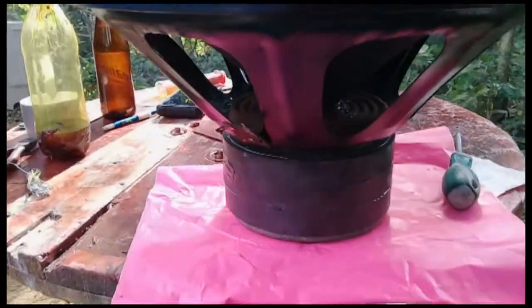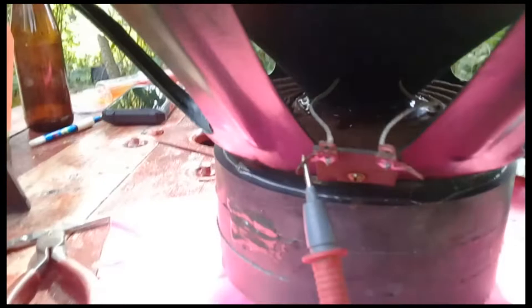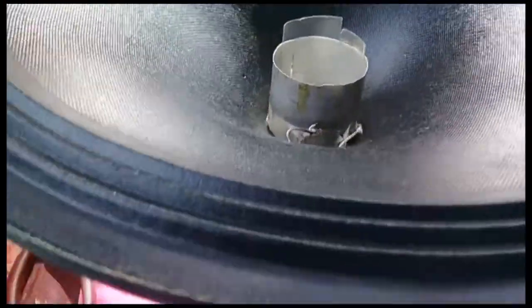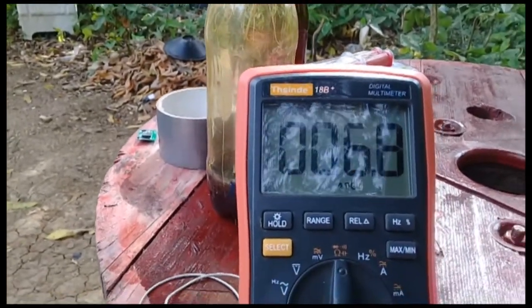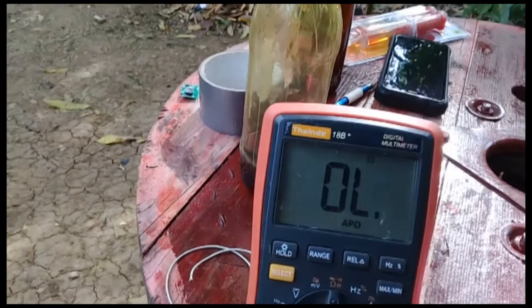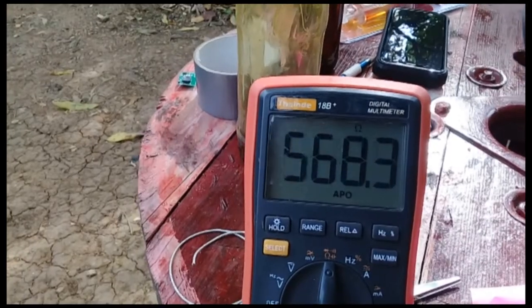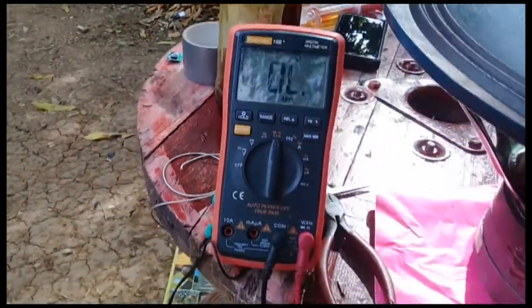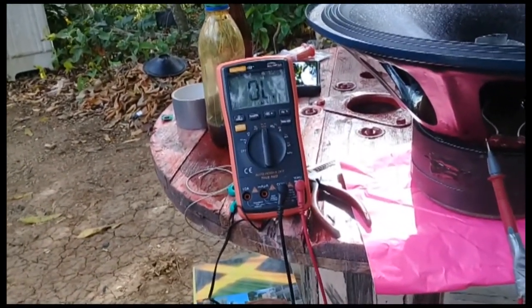The big bad speaker — gluing in the cone right now. Time to put on the lead wire. The lead wire is on the cup but not epoxied up yet. Running a test now to see the ohms: reads 6.8 ohms — not too bad.